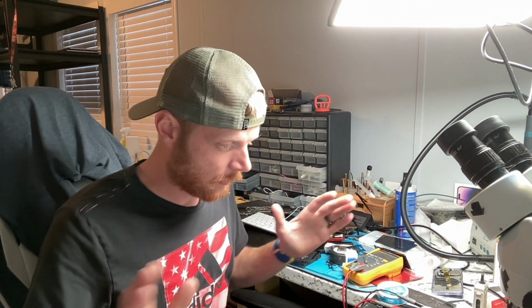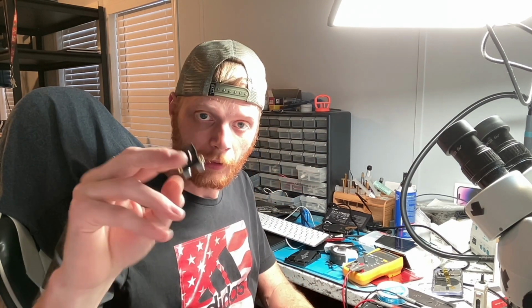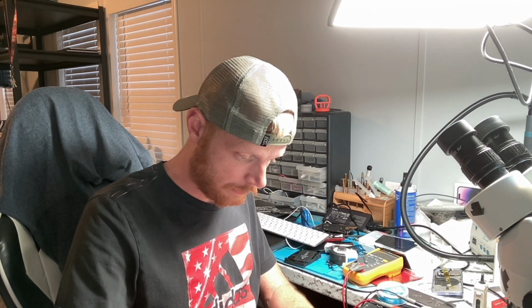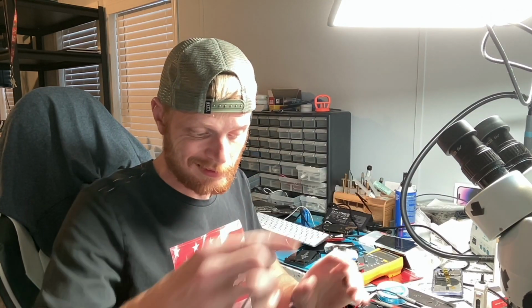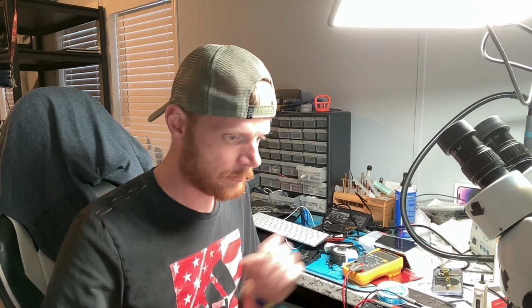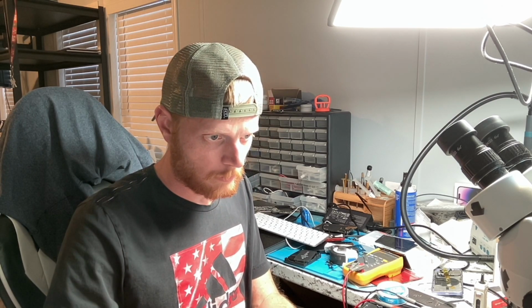All right, so the board should be cool enough. And while we were waiting for it to cool, I found my little adapter to plug into the MacBook here. And to see what we get, drum roll please. If you guys want to place bets, I am betting we still get a 500 milliamp draw, but let's make sure. Okay, 5 volt, 164. That is not expected, I'm not going to lie to you. Let's check this other port. Oh, there it is. All right, so that port got a 500 milliamp draw.